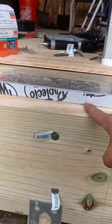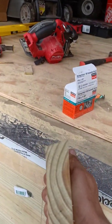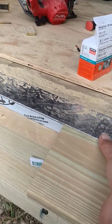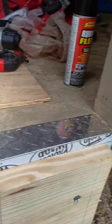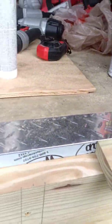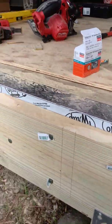And like I said before, make sure you notch that, and if you notch your board at your slope angle, this all meets up perfectly with your edge here. And then I'll show you how to deal with the drip edge in the next video, or maybe the one after that. We'll see. But yeah, that's where we're at. All right, guys.